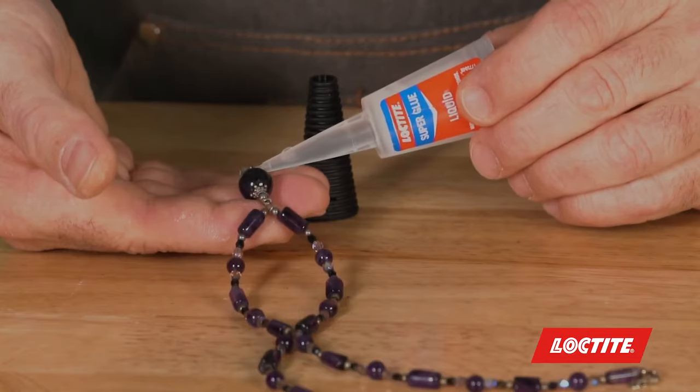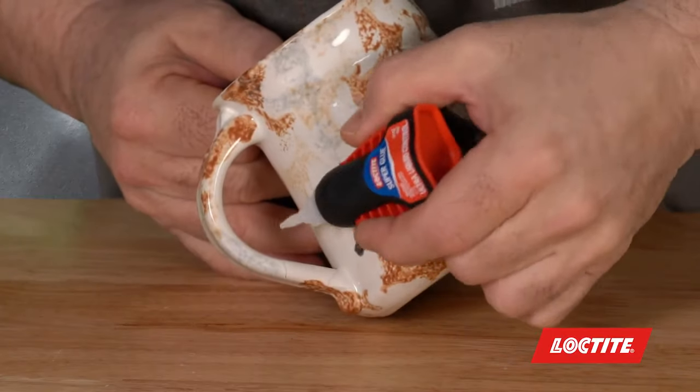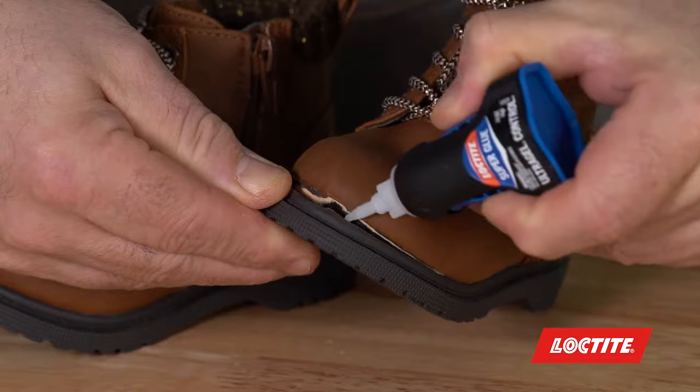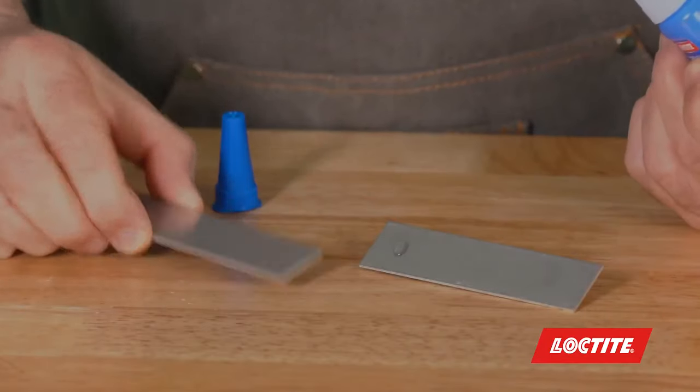What are they good for? Well, I'll tell you what they're good for. Superglues are best for tight-fitting quick repairs and work especially well when used in a thin film. To use it, just apply about one drop per square inch of surface area, then carefully position and hold the pieces together, trying not to reposition or jiggle.